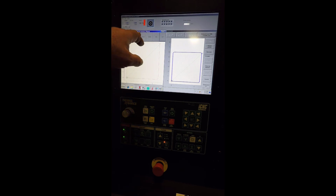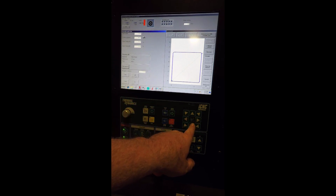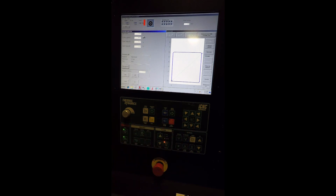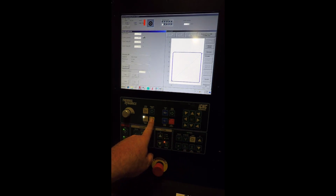Okay, now the plate button is where you can align your plate. So if you have a plate on the table that's not lined up perfect, you can jog the machine to various points. You'll use the laser on the torch and select one corner of the plate, and then select another corner of the plate. So let's do it. So we go into manual mode. We would come over, find the corner of our plate with the laser, hit zero,